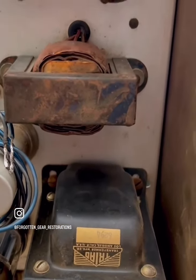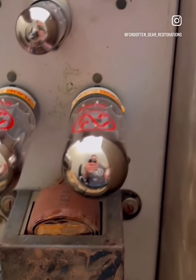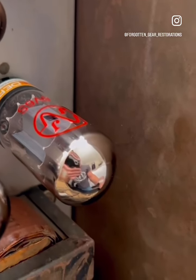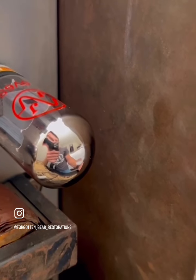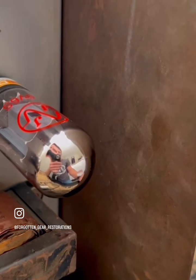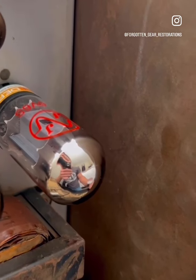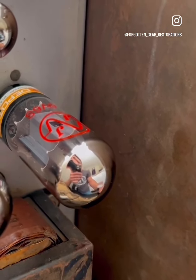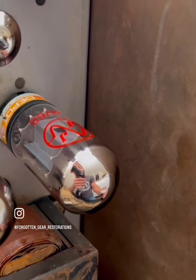You will find that these act more like 6L6s, and that's basically what these are inside of a shorter glass envelope. So if you want to change again the overdrive characteristics and the headroom, the perceived headroom anyway, then you can switch over to, I don't want to say legitimate, but to more classic 6V6 tubes. If you're looking for new production, I love the TAD stuff. But otherwise, these JJs sound really nice.